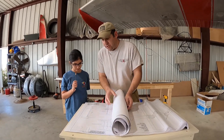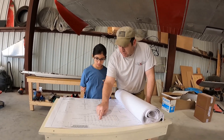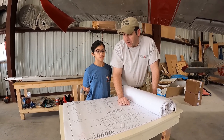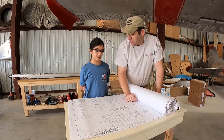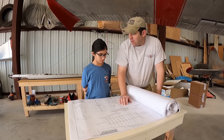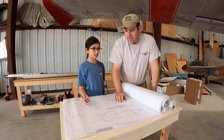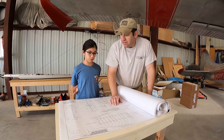It's right here on this page. This is the main spar — the big structure that holds all the way to the airplane. This is the rear spar. The rear spar keeps the wing straight and doesn't let it twist or warp — that's the extra strength. In between those two spars are all the ribs. The ribs give the wings their shape, and that's why it kind of looks like a ladder. Once we get all the structure built, then we'll put the skin on it and that will be the wing. It's like building a skeleton, then later putting on a skin.